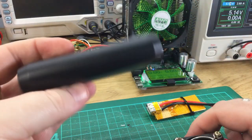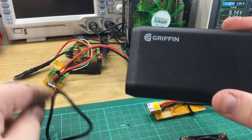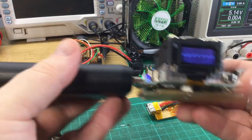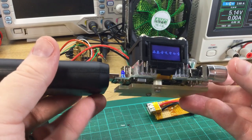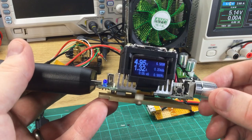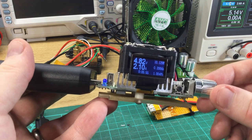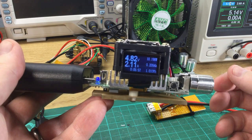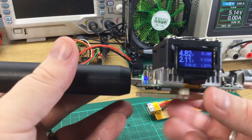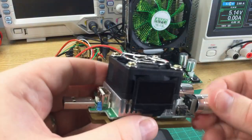So it does seem to work as advertised. The cable is not complete rubbish, but the voltage drops a little bit. It's not great — I'd be expecting a steady 5 volts, so for it not to do that even at 2.1 amps, which is relatively common, is disappointing. I'm probably not going to be recommending this one, but we'll see how the capacity test goes.